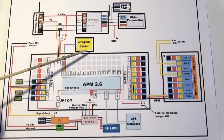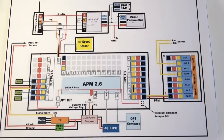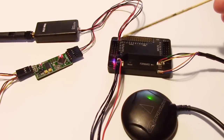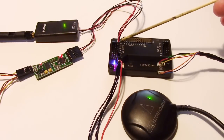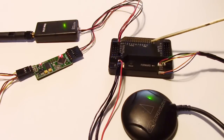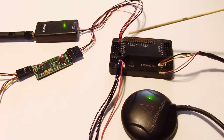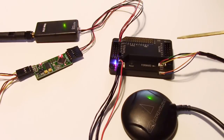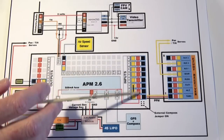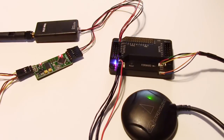There's also the airspeed sensor, which I don't have right now, but it plugs into these pins — just one servo cable. It's the last pins on this row; this whole row is extra pins we won't be using except for these last two where we connect the airspeed sensor. You can pretty much ignore those for now. These are the input pins as shown on the schematic. The output pins are right here — that's where the servos will go.